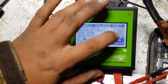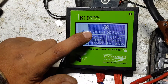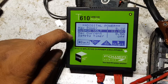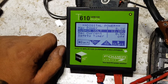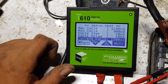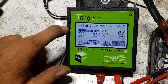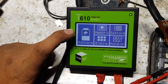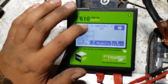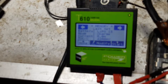Click the balance tab — it says balance port not connected, because I'm only doing one S. In extra mode you can use this as a digital DC power supply: you can pick the wattage, amperage, and voltage, and set a safety timer — say 20 minutes at a maximum of 2 amps and 12 volts. It's also got a servo test so you can test servo motors, and a voltage calibrate to adjust the voltage across all balance ports and the main leads — though it's quite accurate so that's not really necessary. Memory settings let it remember whatever you've done last automatically.